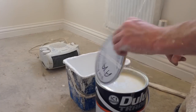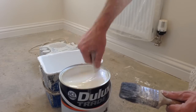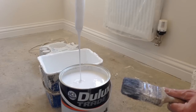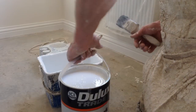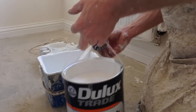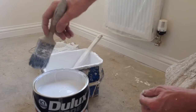And here's the one that's been left at room temperature. Obviously that needs a stir. You can see it's going down quite a lot slower. It's a lot thicker, harder to use, and you'll get more sag out of it while it's trying to dry off.